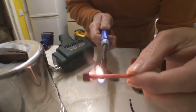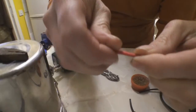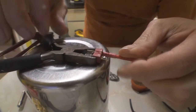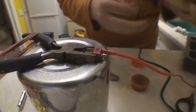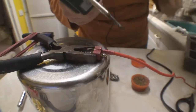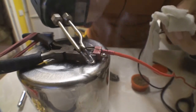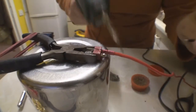And then obviously put your heat shrink on like that. Put your heat shrink on, get soldering on — very hot again. A little tip: if the tip is getting a bit dirty, have a damp cloth, get it very hot, wipe it off — it's nice and clean.